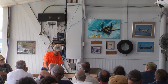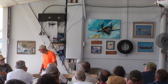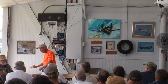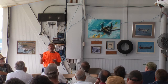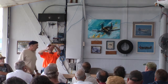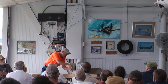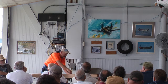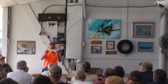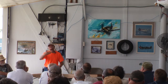And the way I did that was when I finished carving one side, at every station, I would go and make a cardboard pattern. I had one of those large contour gauges with all the little pins, and you push it down into something, it'll set the shape of whatever you're pushing it down on. And so every 6 inches, I would plunge that contour gauge so I have an impression of that particular station. And with that contour gauge, I would make a cardboard pattern like this, so that I had cardboard patterns for the top and cardboard patterns for the bottom.